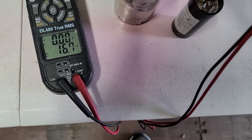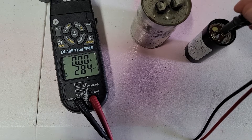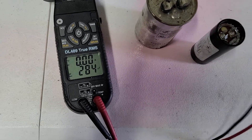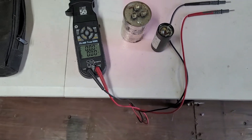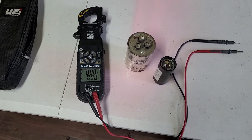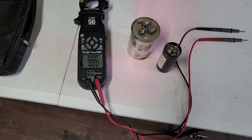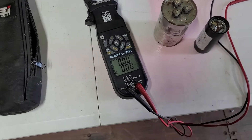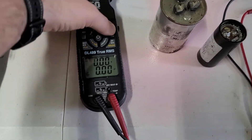Then you can just about forget it with a start capacitor — I can't remember what the range is on this one. See how long it takes? It finally did it, but sometimes when you're reading start capacitors it doesn't even read those properly. Most of the time it just sits there and thinks about it and never gives a range or the proper reading.